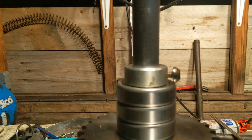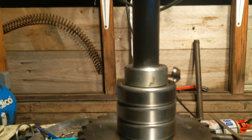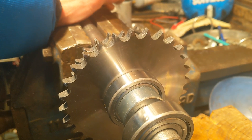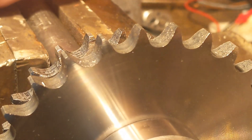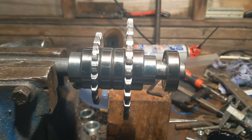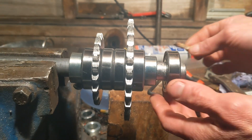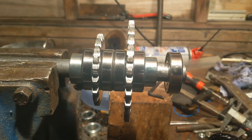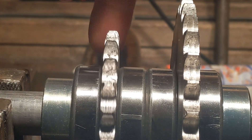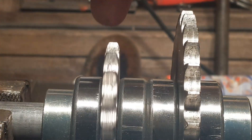I'll tell you what - the epic thing to come out of that is that I seem to have been able to sharpen the drill bit just using a grinder. They're not welded on yet, but I don't think I've done too bad with regards to how central the hole is - that's a biggie. If the drill bit wanders too much right in the middle, it becomes a real problem. It's good - that's pretty good as well.